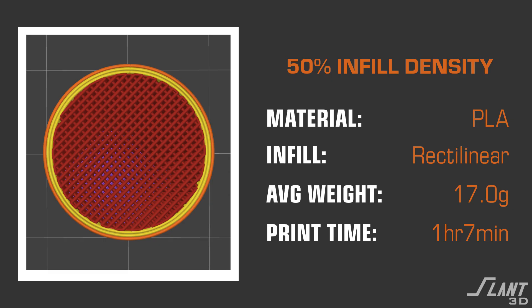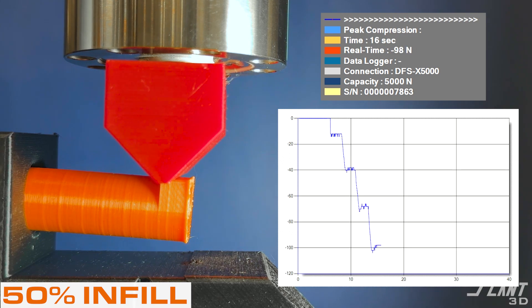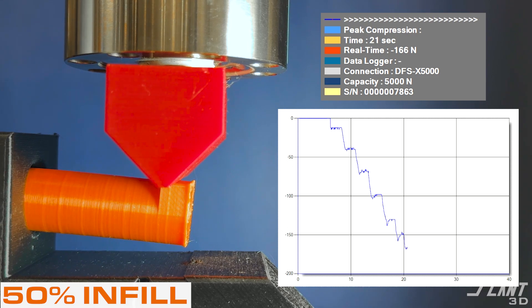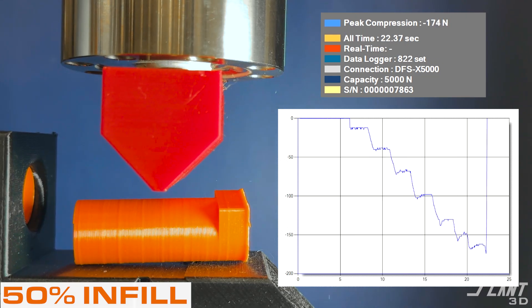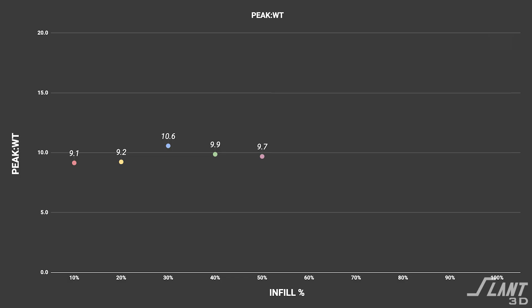Now to the 50% infill — a great big step, as you're almost having a completely enclosed volume now. As the pressure is applied, this one ends up failing at 174 Newtons. While the data on this test was a bit more noisy over the three iterations, the average peak force was 165 Newtons. Still, the strength-to-weight ratio remains at 9.7, following typical material properties — great consistency confirming a good testing setup.